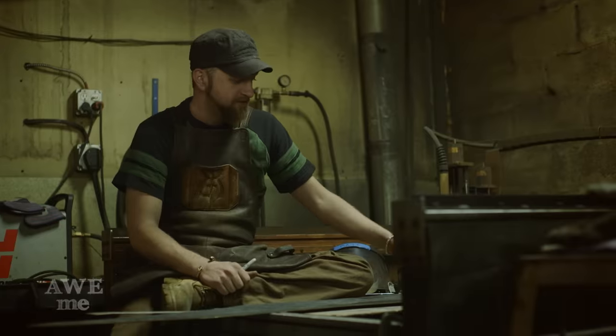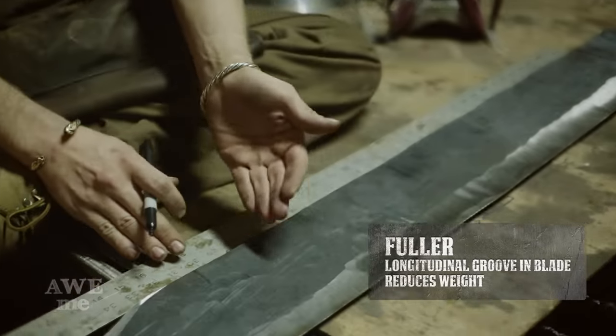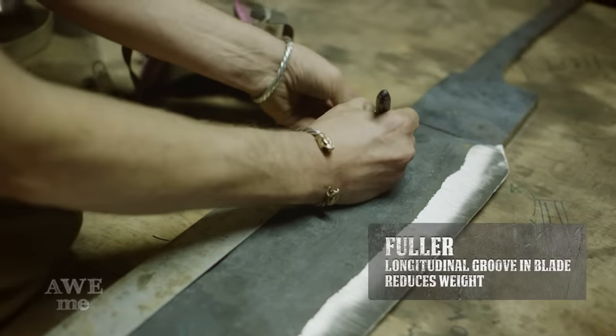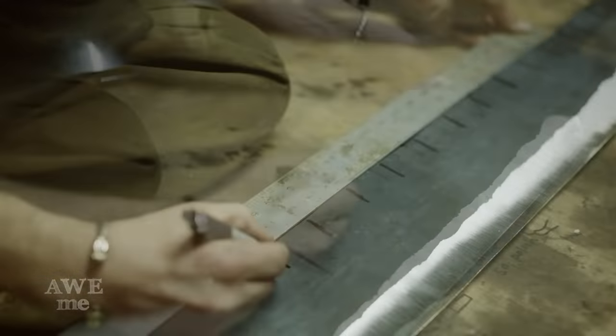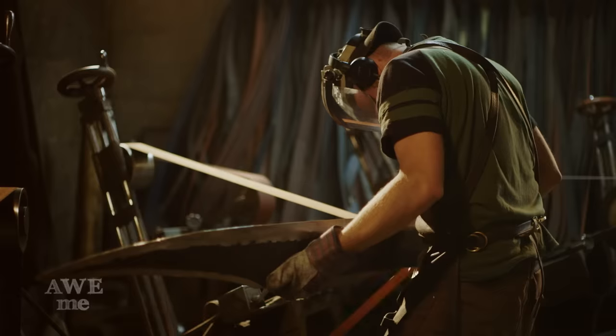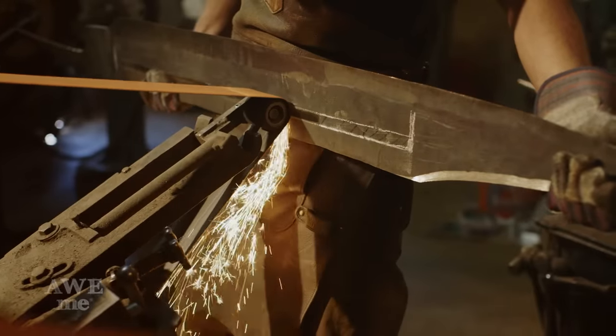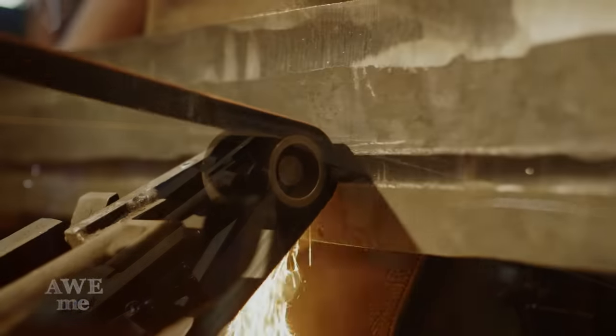Now that Bill and I have most of our edges roughed in, I figured now was a good time to take a break and start laying out where our back serrations and our fuller are gonna go. The back serrations and the fuller both start at the ricasso area and work their way up the blade. I counted in most of the designs about 9 serrations, and the fuller goes all the way almost to the false edge. If you ask 10 different blacksmiths how to put a fuller in a blade, they're probably gonna give you 10 different answers. In this case, I use a 2 inch wheel and just freehand it to shape.